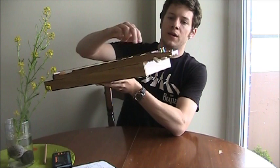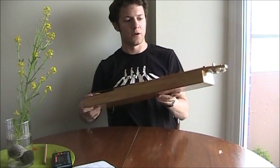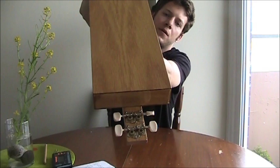The fretboard and nut are just glued in place with wood glue — no screws. The tuning pieces are machine heads, straight machine heads from a guitar. Not very expensive. I went to my local music shop and asked for the most inexpensive ones they had. I had to buy a pack of six since they're for guitars, but you could recycle some off an old instrument like a banjo. I did have to grind the back plates with a Dremel tool to make them fit in the two-and-a-half-inch wide headstock.